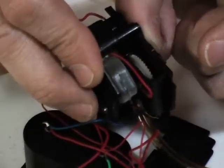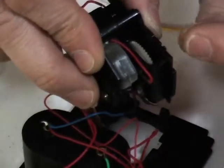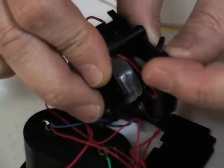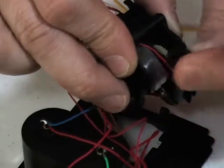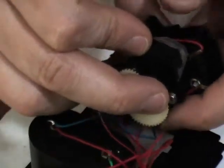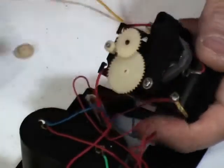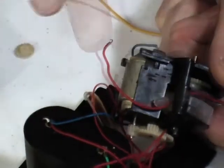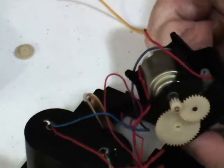Just like the old one, as this gear spins around right here, it pushes two pieces of metal together. Well, now they've added in this, and also as it pushes those two pieces of metal together, it's pushing this little hammer up onto this little bellows pump here. And a screw has come out, and that's why it's fallen apart. So I need to replace that screw. Here's the reason nothing's working. Right here. And this should get going here.